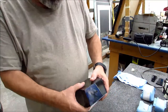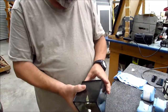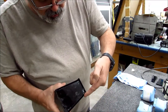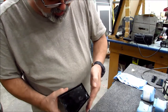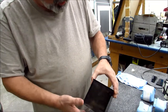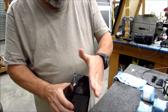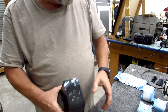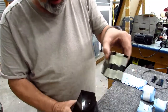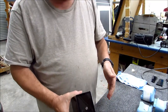Okay, what we're gonna do now, we've got most of our box built. I didn't put the bottom on because I have to put lights in before I put the bottom on, and I'm waiting for the lights to come in. So what we're gonna do is round off, do a half bullnose edge on all of these edges, not the bottom. We'll have to glue the bottom on and then we'll do that. But all of this boxy squareness is going to go away and we'll have nice radius corners. And then what we have taped together here, we'll do the same thing to that and it'll get attached there with the lights included. And so anyway, we're going to go to the wheel and do that right now.